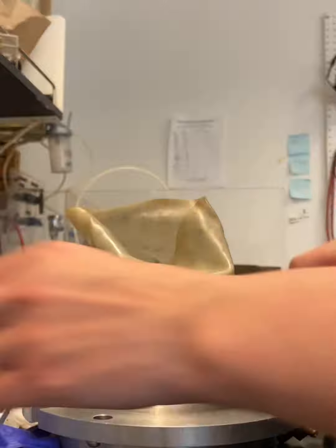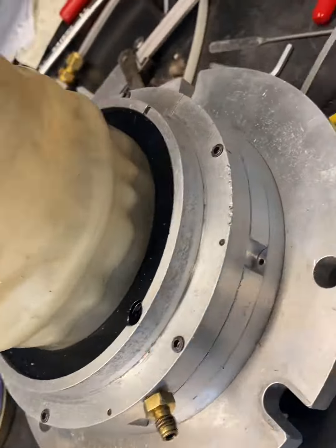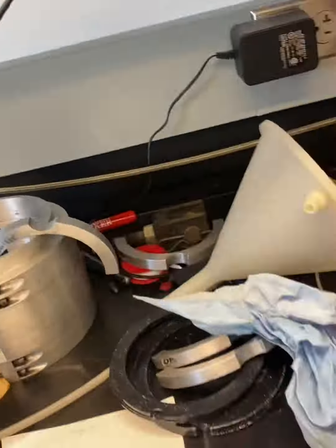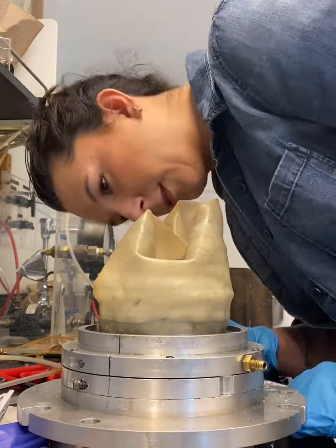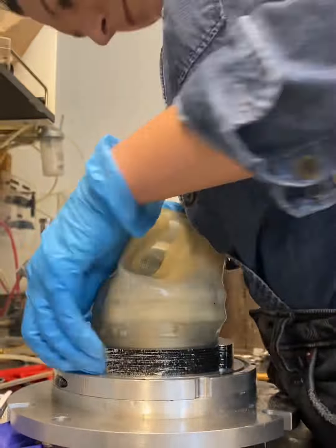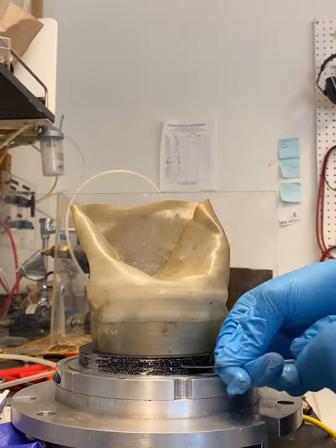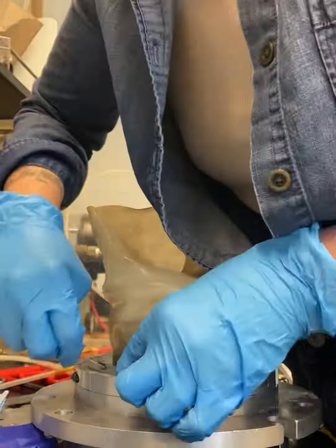So now we have the ring with the 6 screws around, and you'll want to loosen these up in sequence. And then I leave them in the manner in which I took them off, so that whenever I run my next shear wave velocity test, it's easy to tell how I'm going to make my sample again. And so here I'm very carefully removing each ring from the bottom. I use a spatula and I very carefully lift each one off around the membranes. That way I don't damage the membrane as I'm doing this.